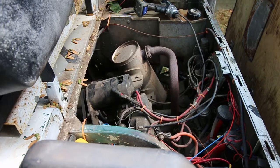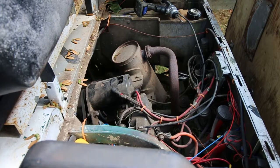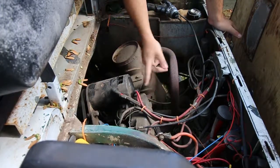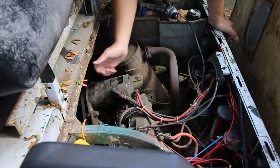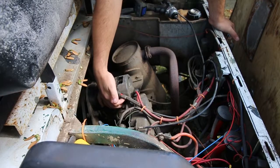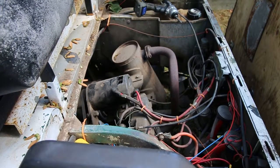One of the ways I like to work is with as little work as possible. So we are going to change as many of these brushes without taking this motor out, then we'll take the motor out if we have to. We're going to leave all the wires hooked up so I don't have to mark those at all - we're just going to flop the motor over. Change - looks like maybe just this bottom brush. At least this bottom brush down here, this one and this one - no problem. This one I might be able to get with it in, then maybe just take the belt off and tip the motor up and change that bottom one out. Minimal effort.